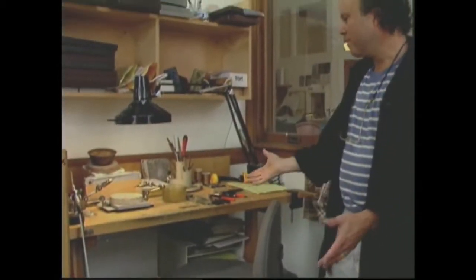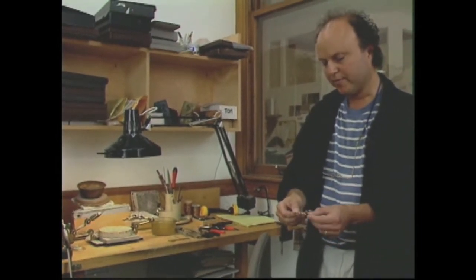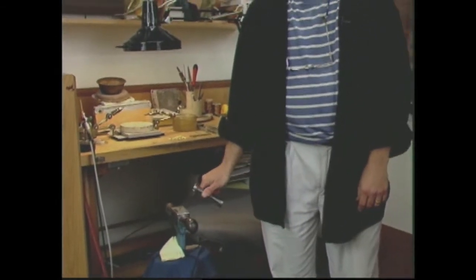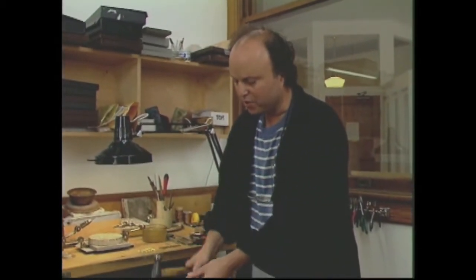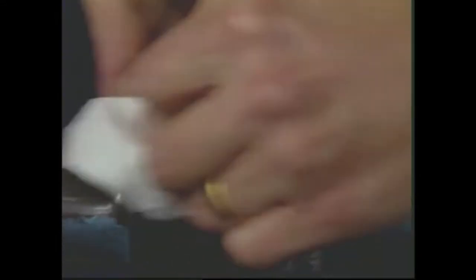That's one thing you do with wire — you create an object, a feeling, a gesture. I've been doing it thirty years and I'm amazed I keep being able to do new designs. It amazes me that there's more to do, and there probably always will be. This is my workbench. We're going to bring the pieces we've bent and hammer them to form the bracelet. The first thing we do every day is polish the hammer and the anvil. This is very critical because as I'm hammering on the gold, it's like die-striking — the surface of the hammer and anvil get stamped into the metal. If there are imperfections, they'll get stamped onto the jewelry, and we don't want to have to polish that out. Now that's shiny enough to shave in, you might say.